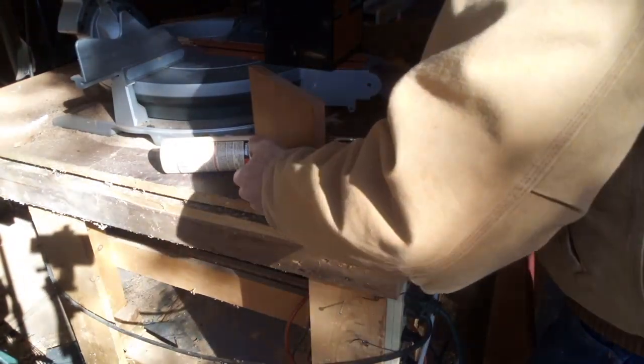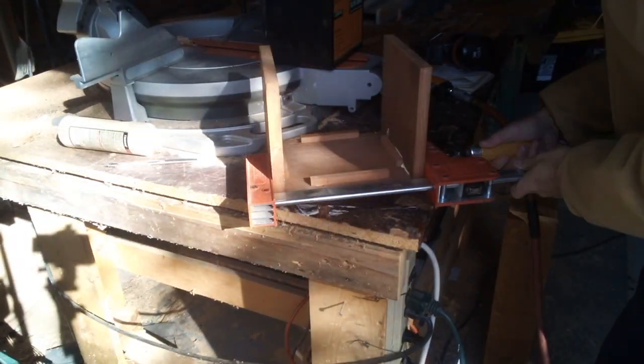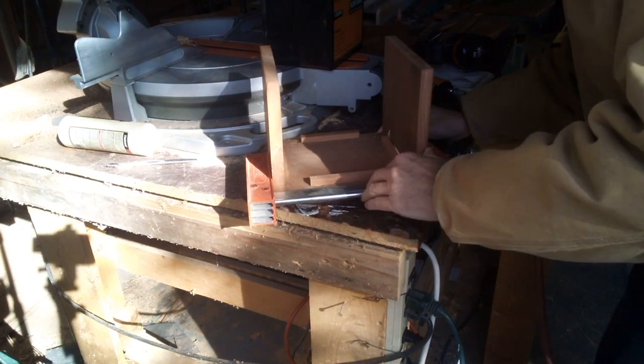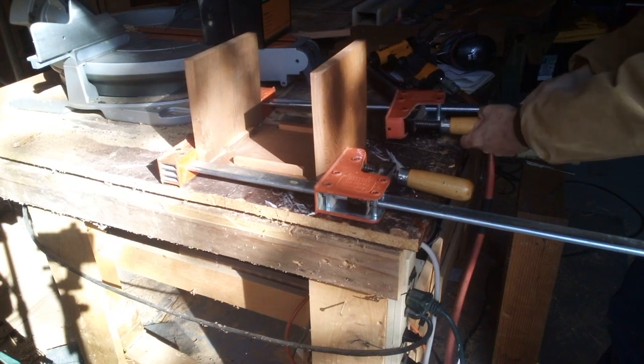So as I mentioned a few minutes ago, the first thing you do is glue up the center first, which is the bottom and the 2 sides. And that way you can put one board on the front without seeing any seam at all, and I think that looks pretty.